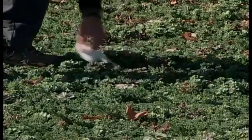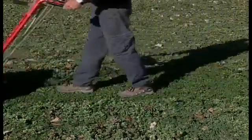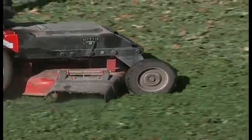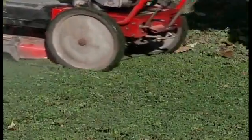Any debris or trash should immediately be removed at every visit, especially during fall and spring. Live roof planting should be raked clean of any matted tree leaves, which could smother the green roof plants. LiveRoof LLC recommends that once a year, around the first of April, the green roof be mowed or weed whacked to break up any dried seed heads and chaff. The clippings should stay on the roof and not be bagged or removed. This regimen has a rejuvenating effect on the plant material and keeps it looking fresh. Forgoing annual mowing may be elected by the owner. Be safe and use proper protective equipment.